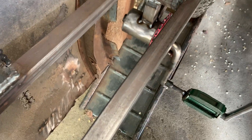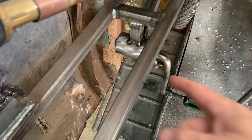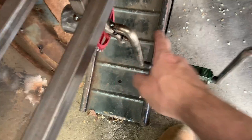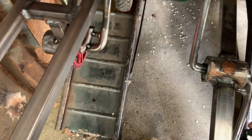I had to cut this bottom bracket free and then put an angle iron across and line it up so that it finally sat right. Then I had to cut this all apart — which I already had together — because this was just a hair shorter than this one. Tacked it, lined it up, but there were a lot of hours in this.